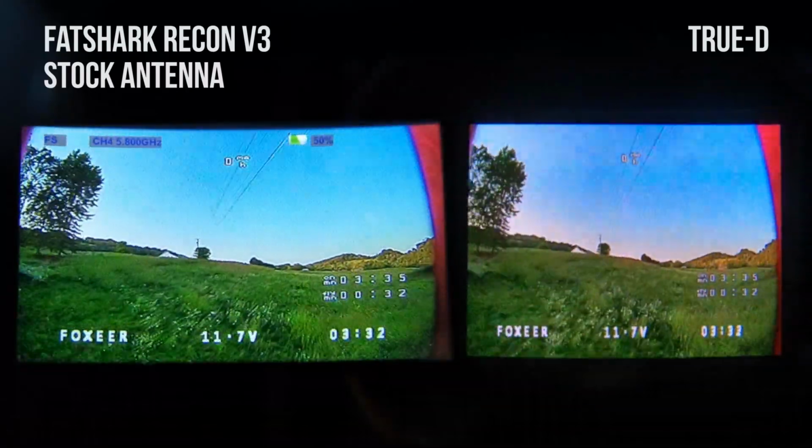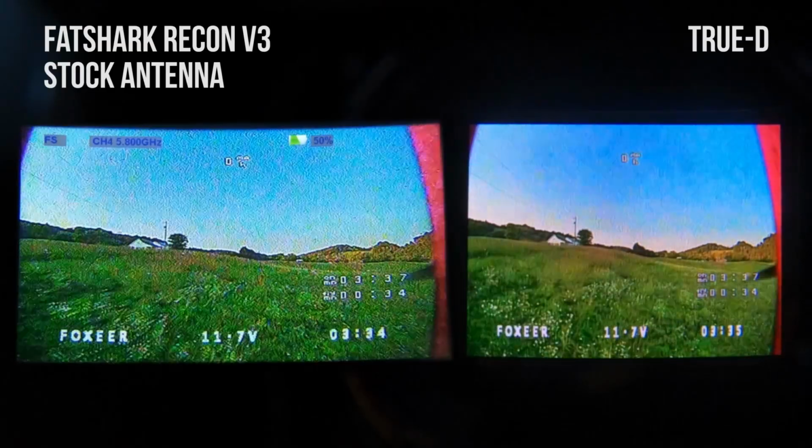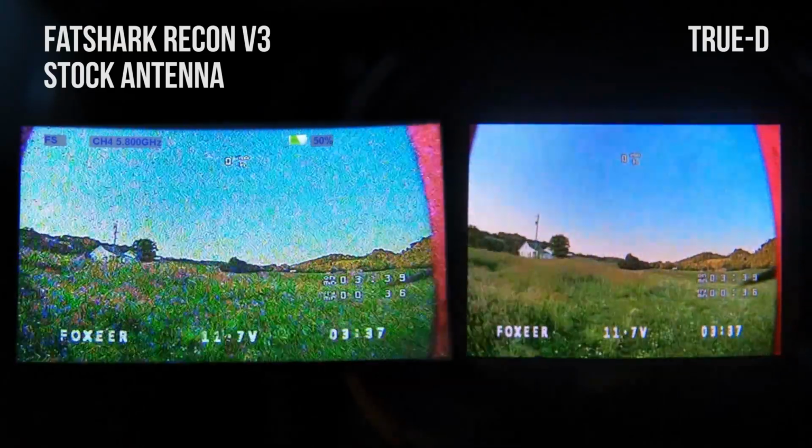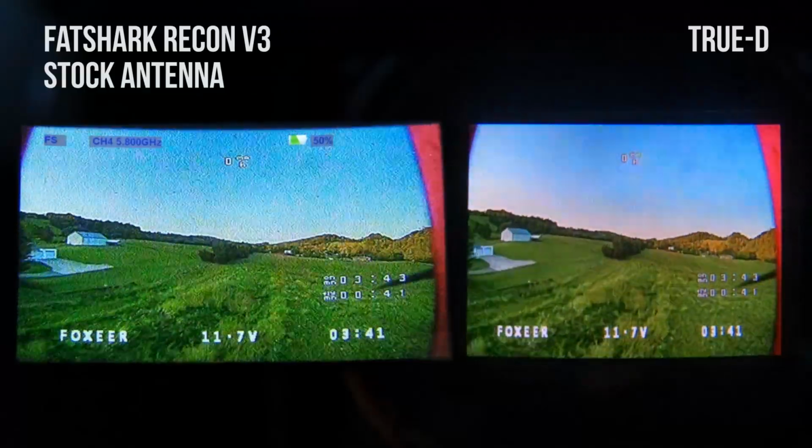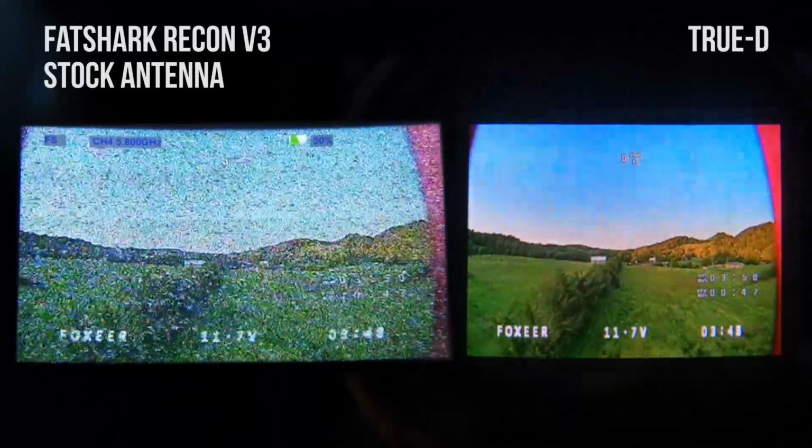Since it doesn't have diversity, most people aren't going to put a patch antenna on it. The performance would be expected to improve somewhat if we had an upgraded Omni antenna, but you don't have diversity. Honestly, I try not to skew the results by commenting on them, but I'm amazed at how far you did get with this stupid little dipole antenna and no diversity.